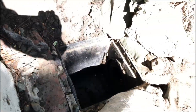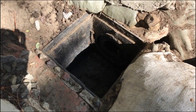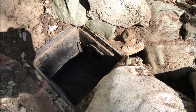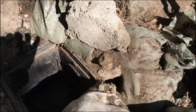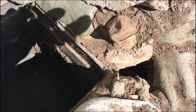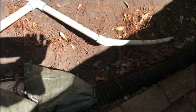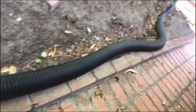So this is the problem during heavy rains — this catch basin and the pipe which flows out of it overflows severely. What I had to do was build temporarily my own catch basin out of sandbags. I ran a secondary pipe for the overflow and just had that pipe run down the hill and drain off to the side, but I want to fix this problem.